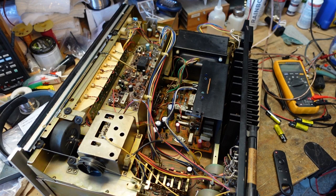If you saw the video on the Rivera amplifier I did, the problem with that is one of those pass-throughs from the top to the bottom of the board had opened up when I pulled the capacitor out, because they did something that I don't approve of personally. They used one of the through holes to mount the capacitor. Those through holes that go from the top to the bottom should be standalone. But in any event, there's about 64 of them that may have to be pinned from top to bottom. But there was a later version of the board that addressed this, and those are riveted. And those are allegedly not problematic. We'll know more about what's going on when we get into this. So I'm going to pull the front off, and we're going to talk about that briefly and take it from there.